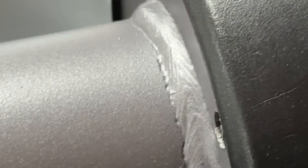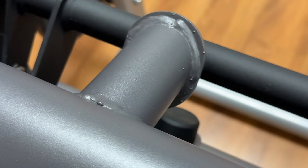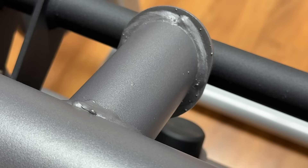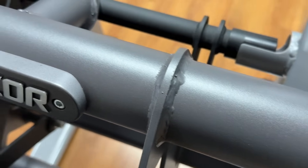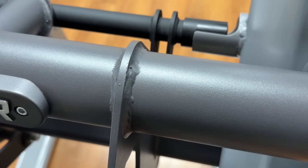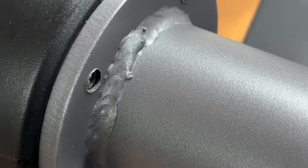Now, what else can you see going on with this welding job? There's one thing in particular that's driving me nuts — it's the post-weld detailing. Take a look at all the splatter we see everywhere. I know that what we're doing here is most likely wire feed with steel, but with any welding job, there is an aspect of post-weld cleanup that we should do. Literally, this takes minutes to take care of — a couple minutes with a chipping hammer or a small chisel. After you finish any welding job, you should make sure that stuff like this is gone. Look how much this stuff shows up after it's been painted. It's so blatant. Even if these welds were all run completely perfect, throwing splatter all over them just makes them look terrible.